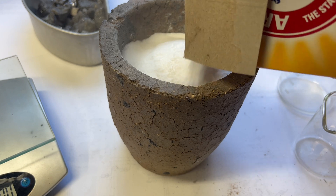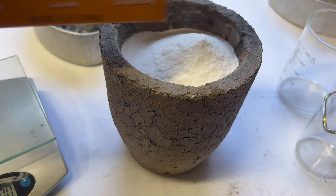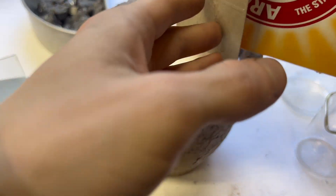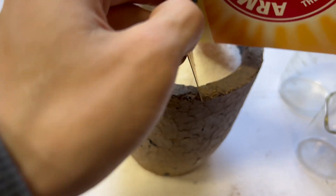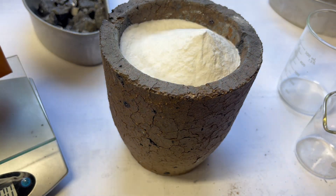We can now start the furnace and get ready to melt as the charge is ready to go. I don't have to mix it up here too well, because once it starts getting hot it'll start forming currents in the fluid, which will mix it all up for me.